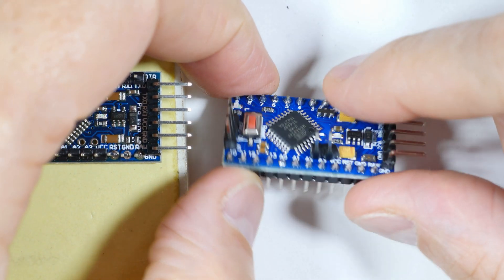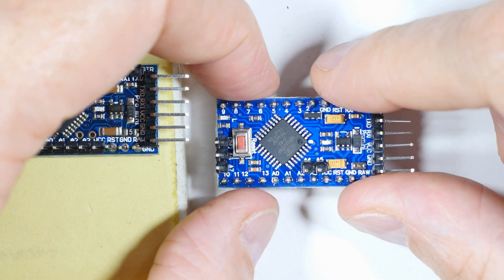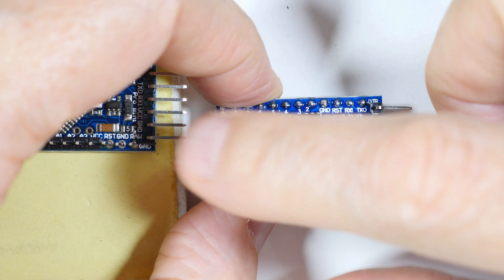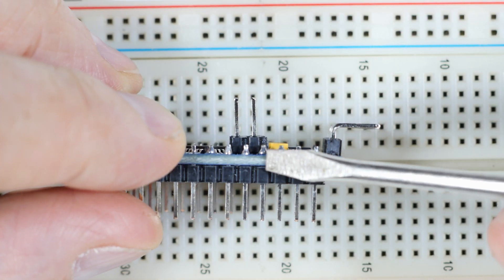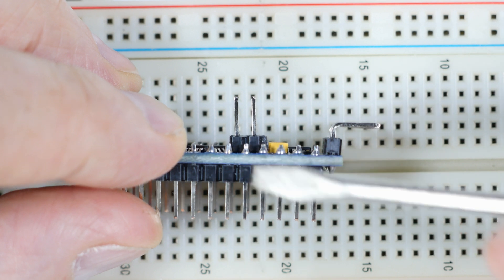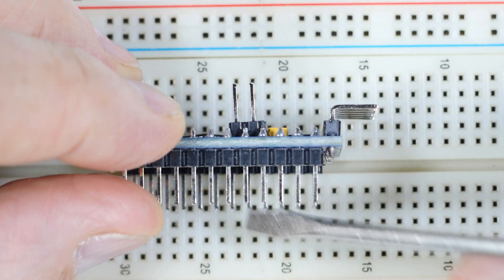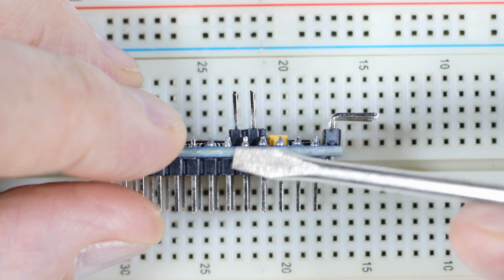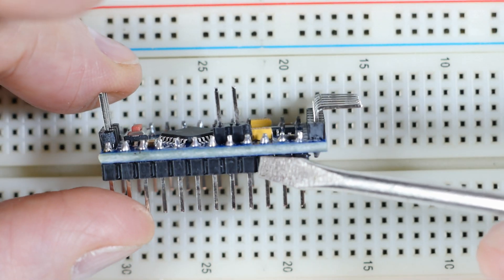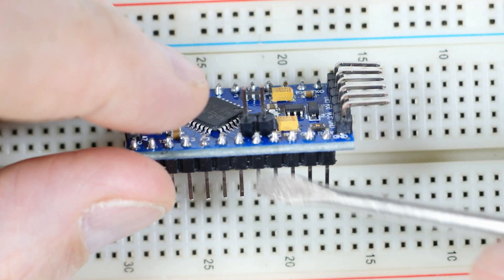There's one more thing on the pins-down version. You'll notice that I've got some pins sticking upward, and you might wonder why I didn't just stick all the pins down. This is one of those things you really have to consider before you start soldering pins in here, or you will end up unsoldering these connector headers. The first problem is looking straight down on this thing — you'll notice that this pin doesn't align with either of these two pins, and that pin is in between these. Since these pins exactly line up with these holes below, these two pins would actually hit in between the holes and not allow the header to go in. Someone close to me made that mistake and had to redo them.